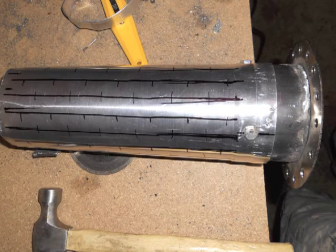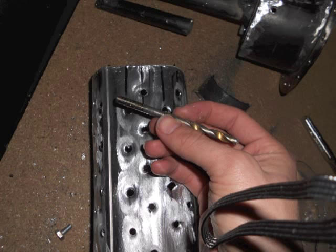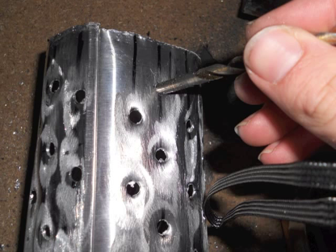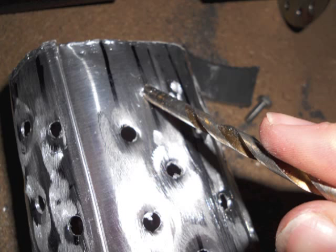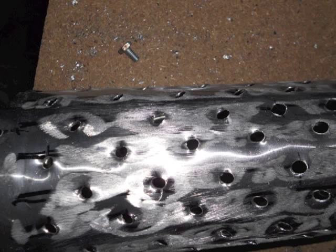Next, we need to drill some holes in the flame tube — I used around 100 holes. If you're making a smaller engine you're going to need less, a bigger engine you're going to need more. The holes will start off small near the bottom of the flame tube and get bigger as they go up — mine were about a quarter inch in diameter. Here's a little trick: this is how the flame tubes are in actual plane engines. Take the drill bit you drilled the holes with, use the solid end, and stick it into the hole. Then bend it straight down towards the bottom of the flame tube so that it makes sort of a cheese-grater effect. This way, when the air is passing by the tube, it will catch and pull it in better.